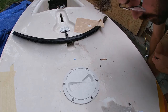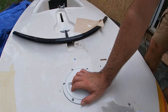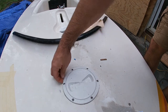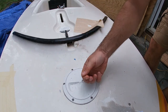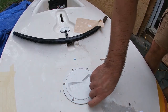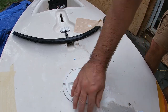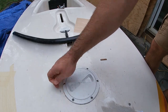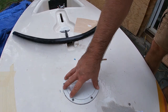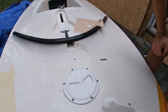My camera decided to stop in there somewhere. I went ahead and finished getting this inspection port installed — got the backside of the screws tightened everything down, and then just went around and peeled off what squeeze-out there was from the butyl tape. I may go back when it's dry outside with some alcohol or spirits just to clean this up — there's a little bit of residue left, and a quick damp rag with some solvent will take that off and make this look really nice. I'll probably tighten the screws down one more time once everything's had a chance to settle. Right now this is good to go and the front of the boat should be reasonably dry.